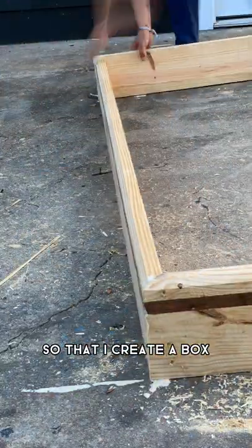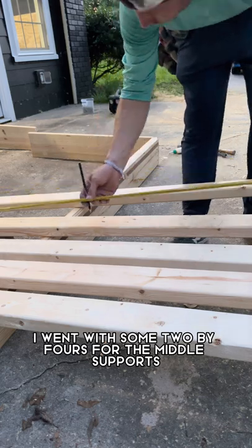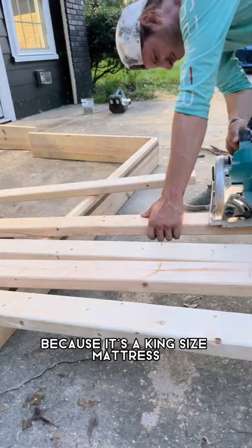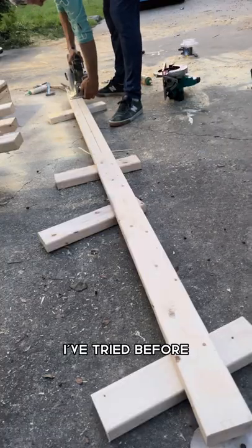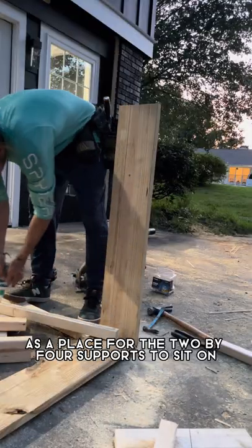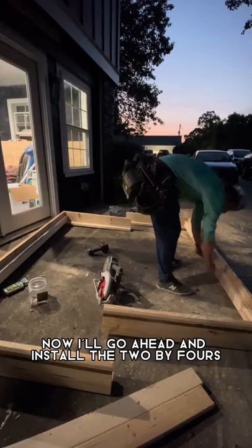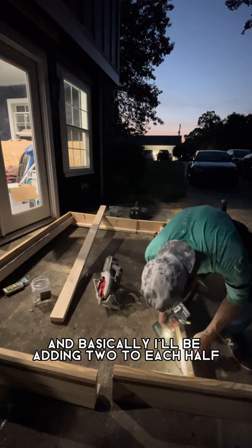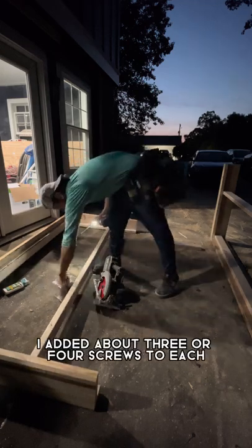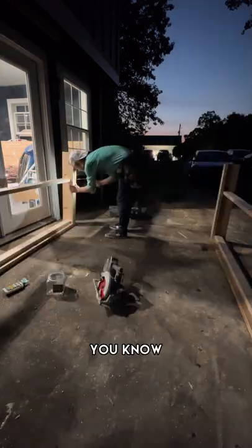I'm going to repeat the process to create a box, screw it all together, and then measure for the middle pieces so I have something to put the mattress on. I went with 2x4s for the middle supports. This bed turned out a little heavy but I had to split it in two anyway because it's a king-sized mattress. I ripped a 2x4 in half to create ledgers — that gives the 2x4 supports something to sit on. I added glue to each ledger strip and attached it about an eighth above the bottom of the bed. I installed two 2x4s per half — one at the end and one in the middle — adding about three or four screws to each end.